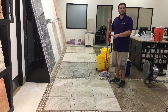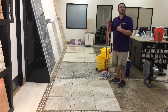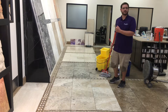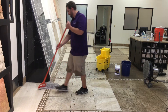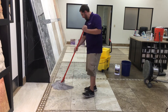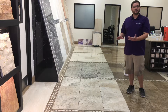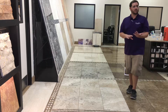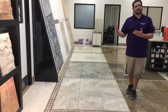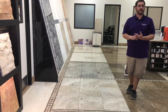Now that the stage with the neutral water and the scrubbing is completed, we're going to damp mop the floors to get rid of any excess water. We'll let that dry, and once it's completely dry, we'll seal it with the natural stone sealer. Some of the important things about sealing from a homeowner's standpoint: it allows you to maintain things a little bit easier, and it allows you to get to spills a little bit quicker so they don't penetrate and stain that stone.